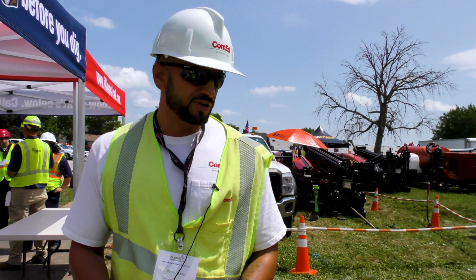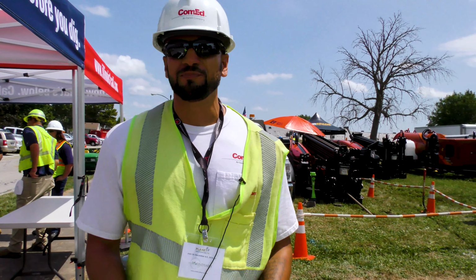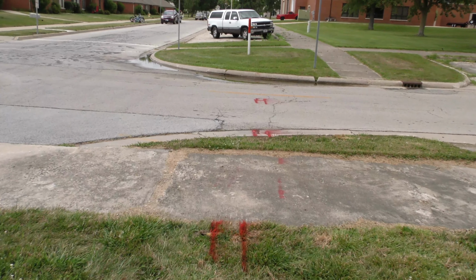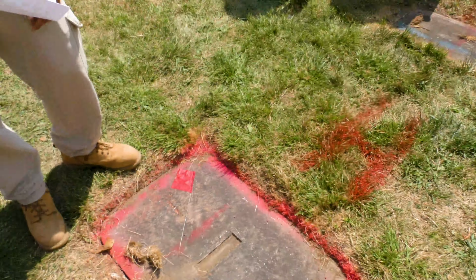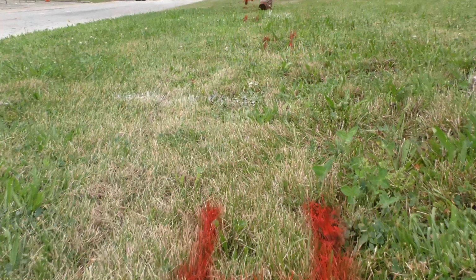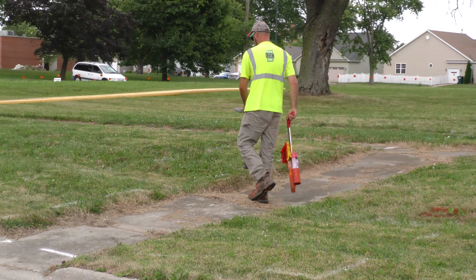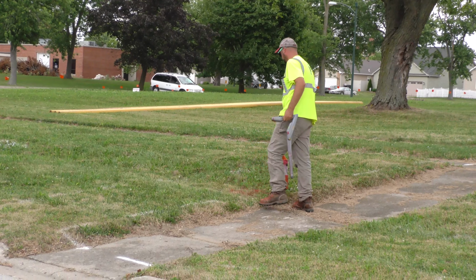Another thing I'm going to do is check the extent, make sure the whole extent of the ticket has been marked, 10 to 15 feet beyond the extent of the ticket also. And I'm also going to look to make sure that our marking standards are within ComEd standards. You know, this is a three-phase primary here, so it should be no more than 4 to 6 inches wide as far as for a three-phase primary. We shouldn't see duct package marks for a three-phase primary. It just makes the contractor's job a whole lot harder, and we've got to make sure that they're marking according to our standards.